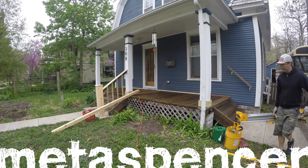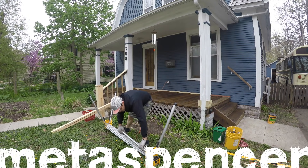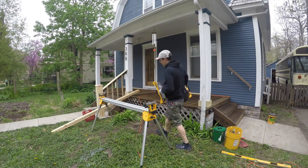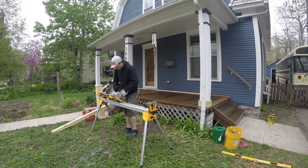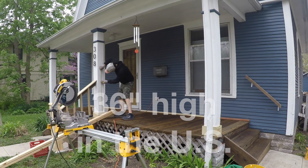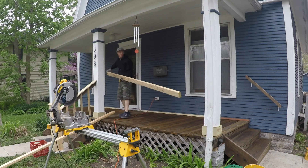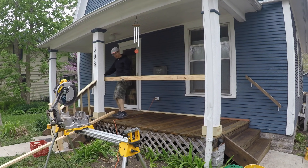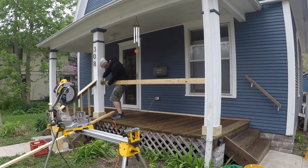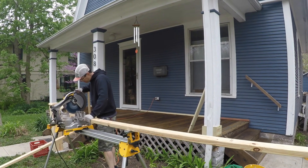In this video I show you how I built a very simple, cheap, functional, minimal, cool-looking railing on the front of our house. All railings on residential houses are supposed to be 36 inches — they're a bit higher if you're building one for a rental. I built this one at 36 inches, that's the standard height, and started out with a 2x4 on top.